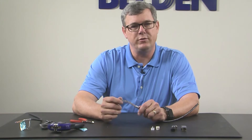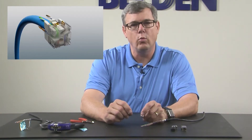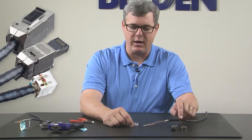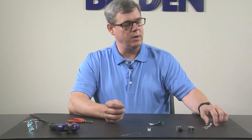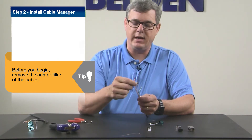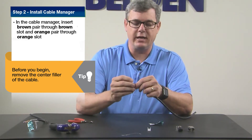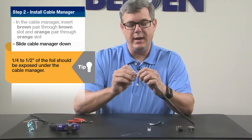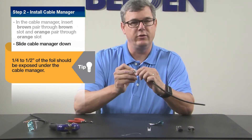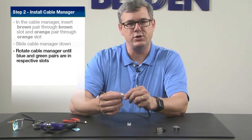From here, it's really the same process whether it's a shielded or unshielded cable. The RevConnect comes with a wire manager and a cap. Together, these two products make the core. Once we go from there, we can make it a plug or we can make it a jack within the process. We start with the RevConnect. If you look at the bottom of the RevConnect plug, you'll notice the wiring scheme for both 568A and 568B. Today we're going to do 568B wiring scheme. To do that, we want to take the brown and the orange pair up. We take the blue and the green pair down from the cable. We line those two cables up with the two color codes, sliding it through the two holes. You'll notice two arrows on the RevConnect wire manager that you can twist in a clockwise direction to line those up.